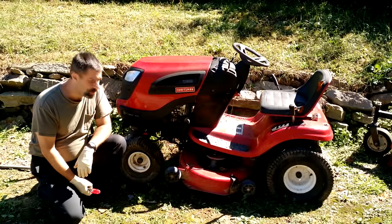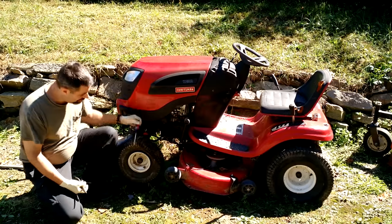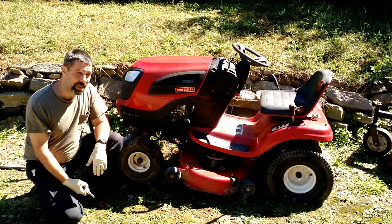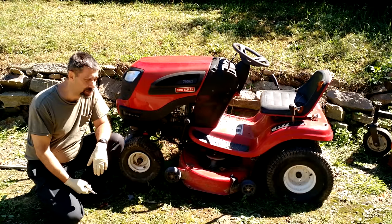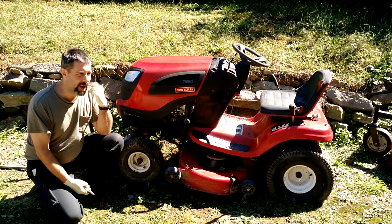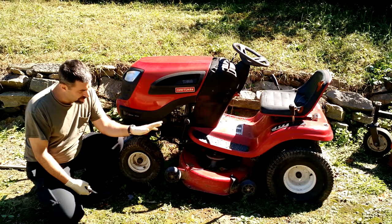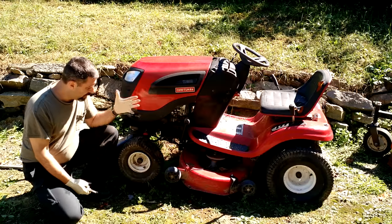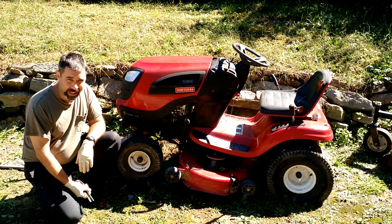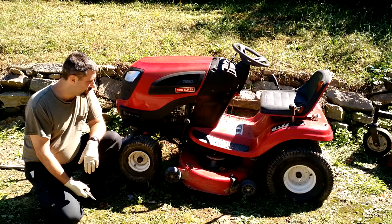Hey guys, it's Eric, owner of Farpoint Farms, and today we're going to be doing something I absolutely hate to do, and that is putting inner tubes in these old tractor tires. This thing has been driving me crazy all year — if you pay close attention to my videos, you'll notice this tractor has been sitting around most of the year right in this very spot. The front tire's completely dry rotted out after four or five years. The rear's slowly leaked down. The front's really been driving me crazy. Even with bead seal in it, this one came completely off the rim because I was running it low. I hit a bump or something, and that was it. I managed to limp it over here, and there it sat for the rest of the season.